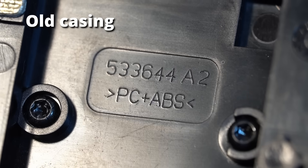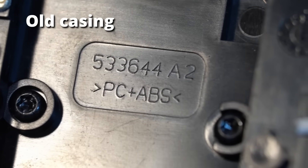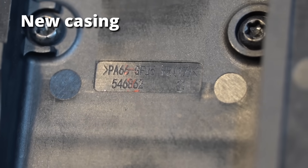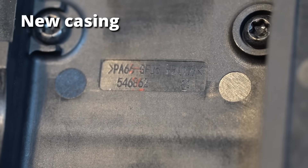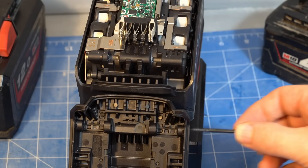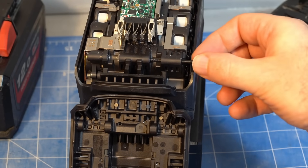The construction of the battery has improved a lot. The material is no longer a polycarbonate and ABS blend, but is using nylon 66, which is stronger and has better heat resistance. The screws are now loaded in triple shear joint with a smooth shoulder so the threads don't dig into the plastic.